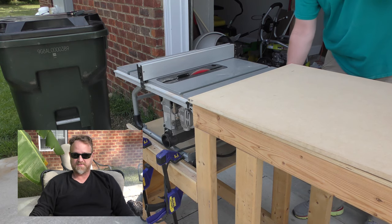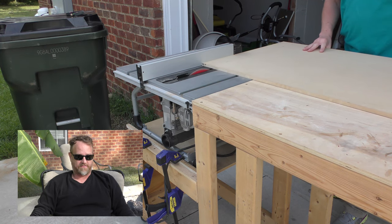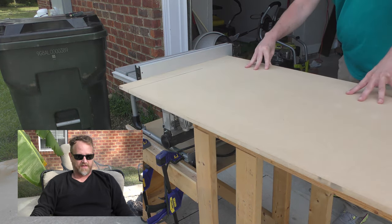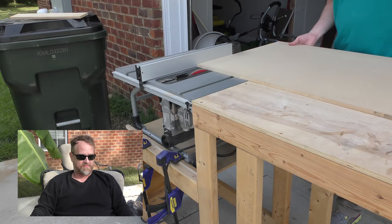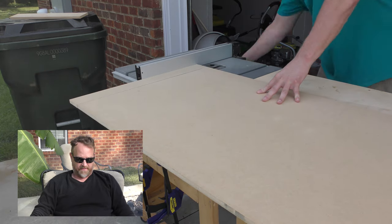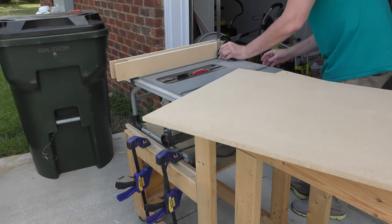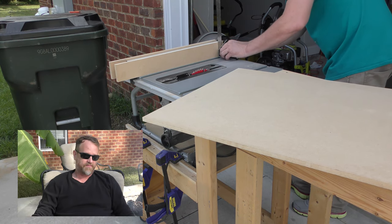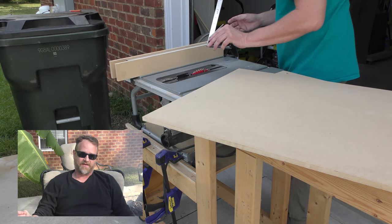So now I do what I should have done in the first place — I went to the big box store and picked up a piece of MDF. The MDF is square, it's flat, it's level. You don't have to worry about it warping too much unless it gets wet or there are extreme conditions, which the spline jig is not going to be subject to. You'll notice I keep checking for square in this whole build — it's really important. I can't stress enough how square this piece has to be.